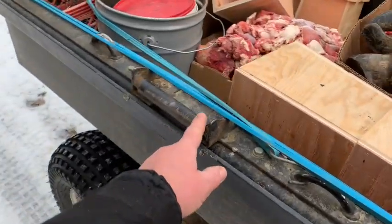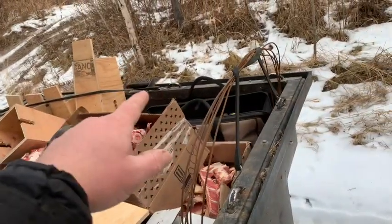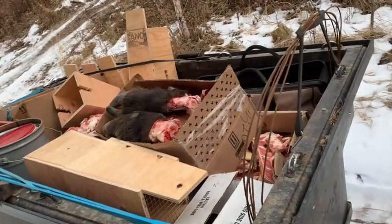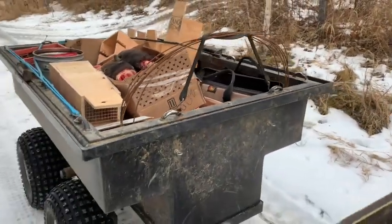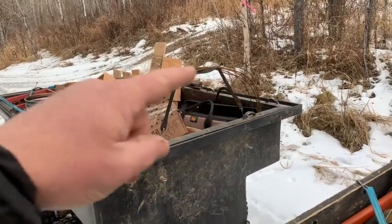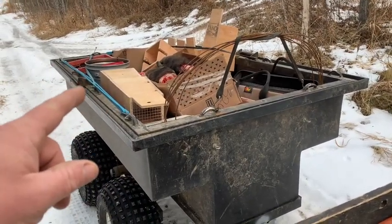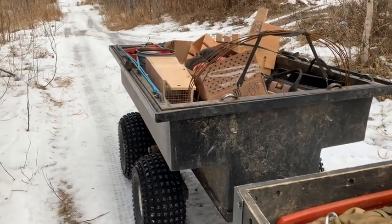That's why I got this little roller that I built here — it's a little guide so we tip them on their side. Moose is on the ground, we put the trailer up against them, try and get his back end on that side if you can. Trailer's on the side and then you just winch over — put a strap around the front leg and the back leg in a V off the top up to the winch cable — and just pull it over top. It'll pull them right into the trailer and eventually flip the trailer back over. But if you don't have this frame, it kind of bends and eventually breaks and wears out the plastic. So grease the axles, make sure everything's good, and it'll last your lifetime.